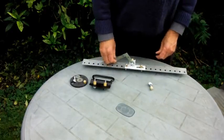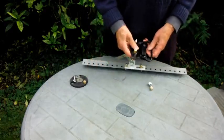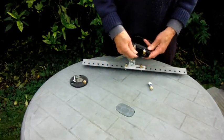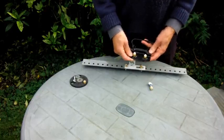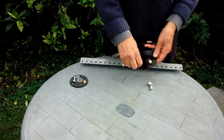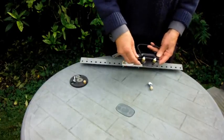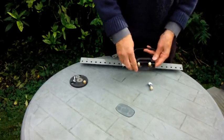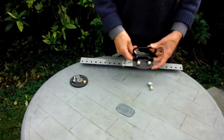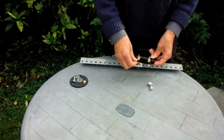An example of using hole clamps for welding work will be for welding fittings to a security toolbox. A couple of holes would be drilled in the side of the box and the fitting bolted on using two hole clamps, as per that. The fitting is then welded round the edges and the hole clamps removed. After removal, the two holes can then be welded up and ground smooth.